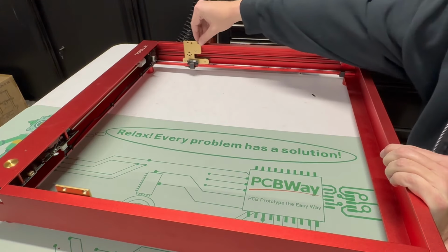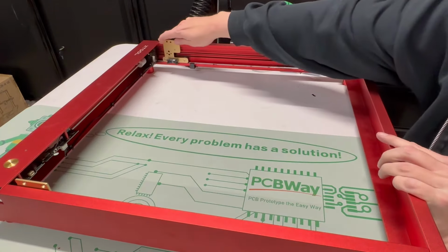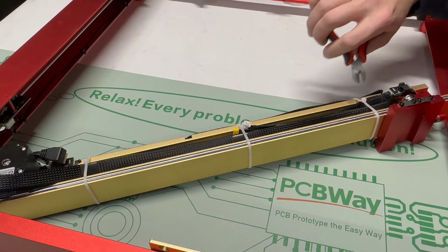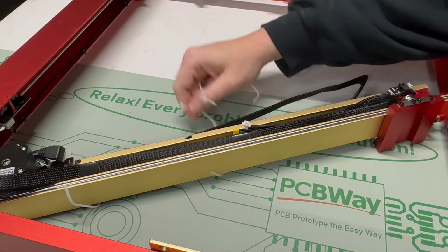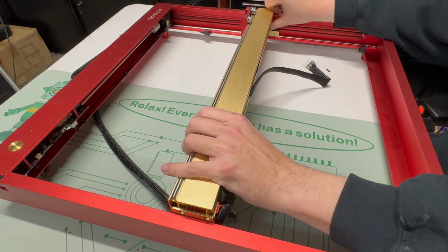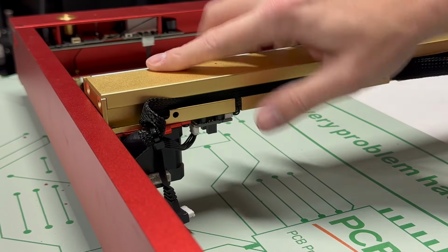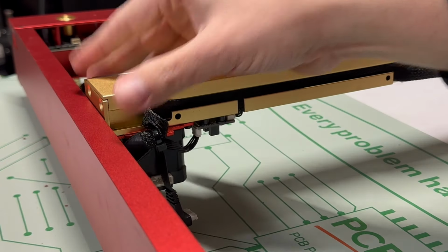You can adjust the tension on the belts and make them loose, move one plate over, but mine are aligned, and I just want to make sure the belt tension is correct. Let's go ahead and remove these zip ties. Careful not to cut the wire or the loom. Now this middle plate is definitely a lot beefier. Which is nice is that these actually have notches on the side that holds it in place. And it almost self-aligns. It'd be nice if the D1 Pro had this feature.